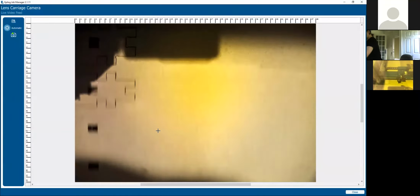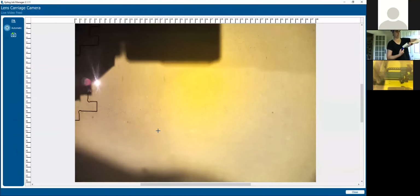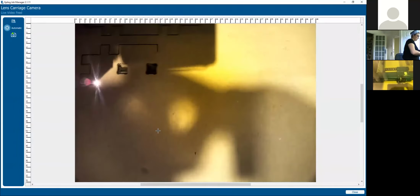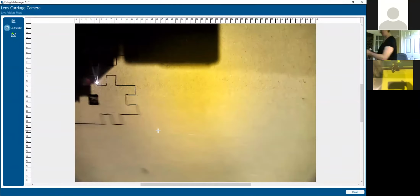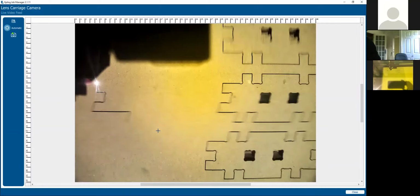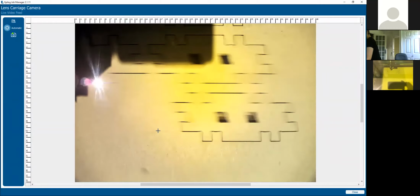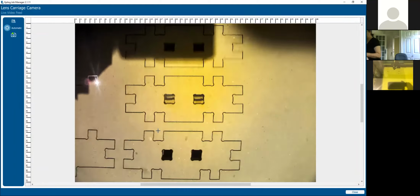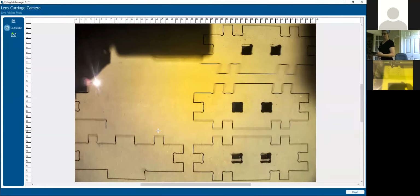thicker materials such as acrylic sheet, which is going to be like the main use that we have in here, but also woods. Cardboard's okay. I'm just using cardboard because I'm overloaded with it right now. I spend half of my day breaking down cardboard boxes, it seems like. But this cardboard is corrugated, so it's got this air gap in the middle of it, which can cause fires sometimes. Embers can get stuck in there.